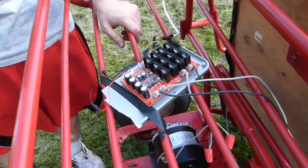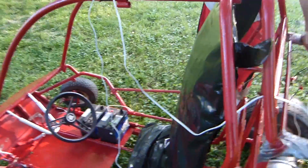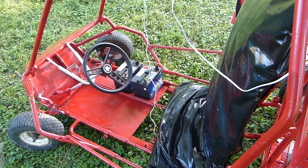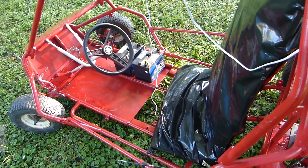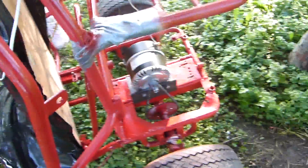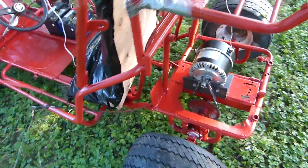So what are you gonna do to make this a lot better? Well, we're gonna get a real motor controller, something with reverse. I'll actually have a pedal throttle, and it'll fix the brake. So at least it'll be rideable. New motor controller, fix the brakes, fix the seat, new batteries. Well, we'll just mount the batteries right. We're gonna have multiple iterations of this thing, just to see what works and what doesn't. Then a better, real throttle. Well, that's what I'm getting on Tuesday or something. So that was ride number 1. It can only get better from here. Oh yeah.